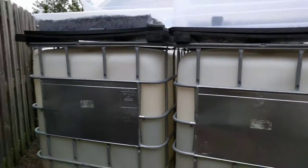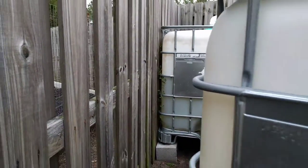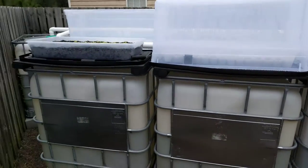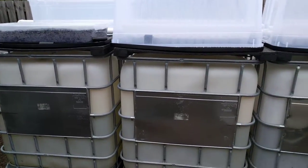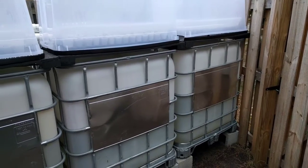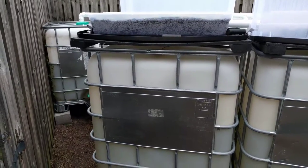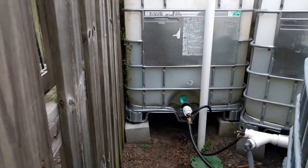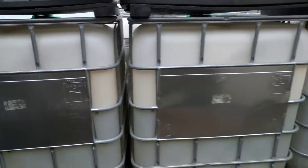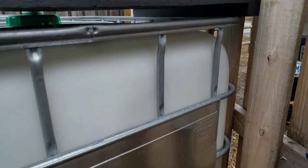I did have a comment on a video about the rainwater collection tanks about running ozone through it. I'm not too familiar with that process or the amount of electricity it would require to run ozone through that kind of volume, so I'd be curious if anyone else has done that. I actually designed the system so that the flow rate going outward on a monthly basis is almost exactly equivalent to the entire system's volume — so about 2,000 gallons leave every single month.